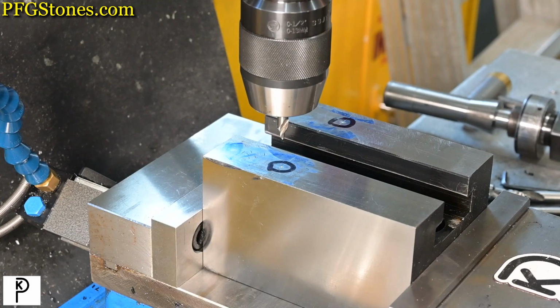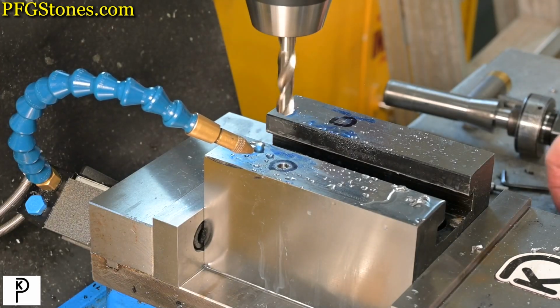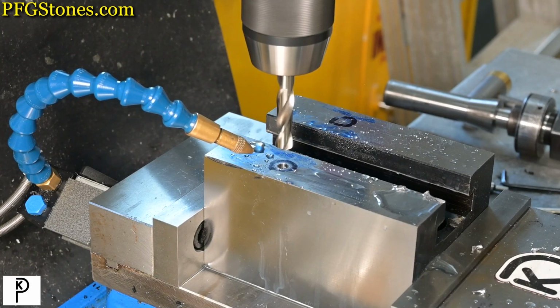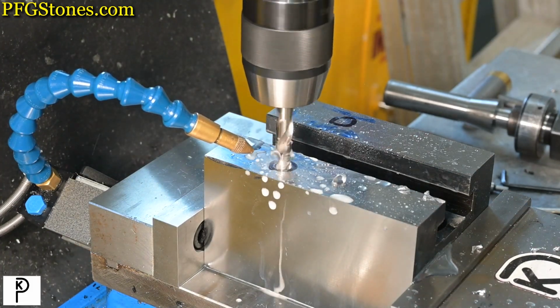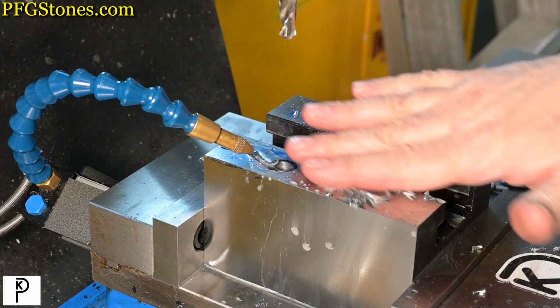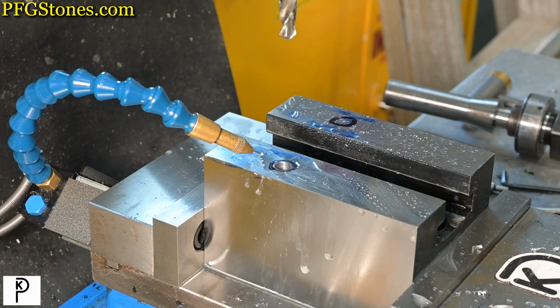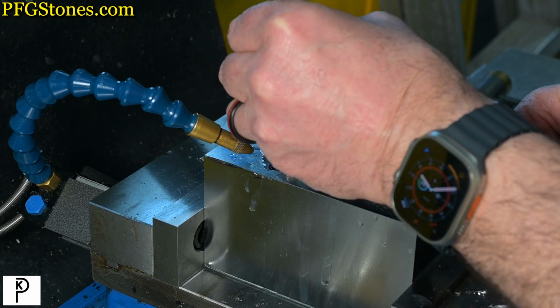Spot on. I'm ready to go. Okay, so off camera, we spotted and drilled a pilot hole to 0.7 inches deep. And now we're gonna go put the W drill in the same way. It came out nice. All right. So let's see if we take a measurement here. 3885. Okay.